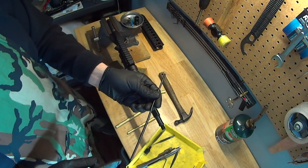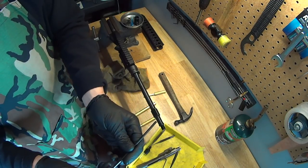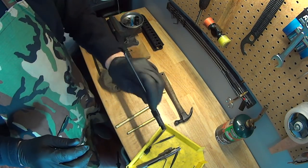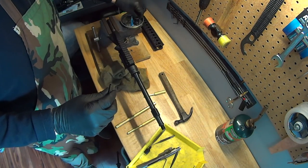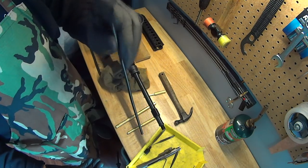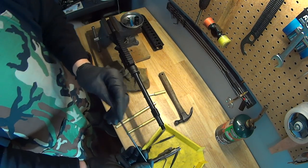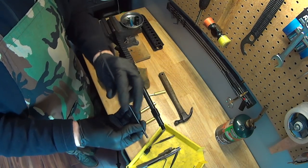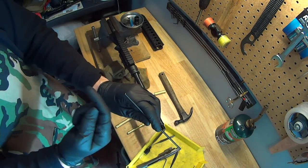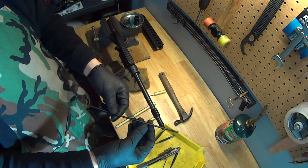The next part is the gas tube. When you're doing the gas tube, make sure you put this end in your mouth and you blow through the gas tube to make sure that if there's anything in here, it presents itself here. Also, if you shake back and forth, if there is something in the gas tube, you'll hear it. And sometimes things do end up in gas tubes, little metal filings and whatnot. So basically, you would put this in your mouth, you'd blow, do not inhale, don't suck. You'll tell you what, do it one time and you'll know why. You'll go, oh, that's an interesting flavor.